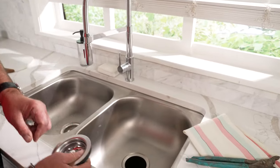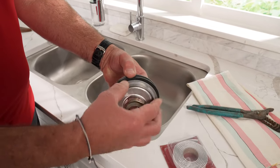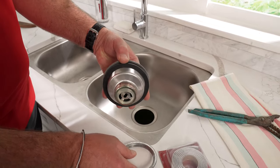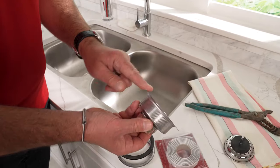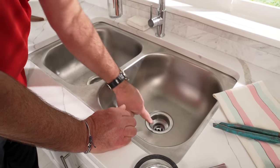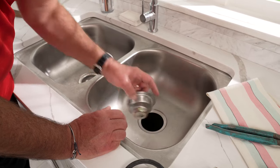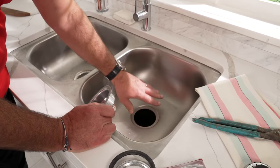Here I've got a stainless steel sink and you can see there's no drain assembly whatsoever. This drain assembly comes apart. There's a threaded ring here that's going to go under the sink. This washer will also go under the sink. But then this portion will actually go into the sink like this. The plumber's putty goes underneath this ridge because as you tighten it, that's what seals the drain assembly to the sink.